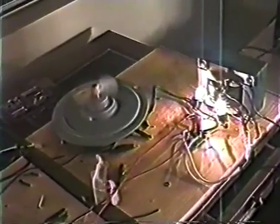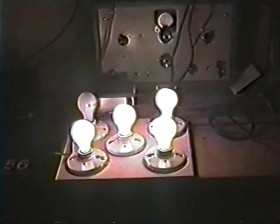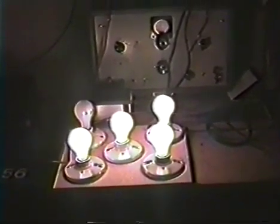And we're showing that this power can be transformed and can be rectified just exactly like normal positive power, except again the power is very cool in the actual lines and feeder circuits. Only in the actual resistive load do you have translation into normal power. But it can be run through a transformer and stepped down or stepped up. It can be rectified, and we can handle the power just indeed as we do normal power. And you see again at the same time we have 4 of those lamps now lit. And so we have another 400 watts resistive load going here at the same time.